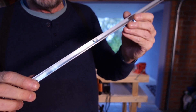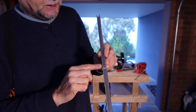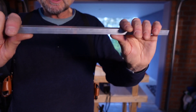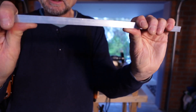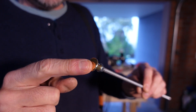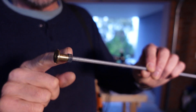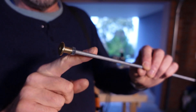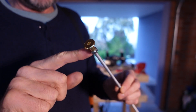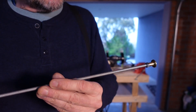The square nut can now fit inside the channel with a simple friction fit. That's going to displace the threaded rod towards the bottom of the neck, so that when it is tightened the whole assembly will bend, pushing up in the middle. I call the furniture end nut the tension nut, and a regular hex nut on the inside of it I call the torque nut. I'm going to grind three faces of the torque nut square so that they'll fit inside the channel and prevent the rod from turning.